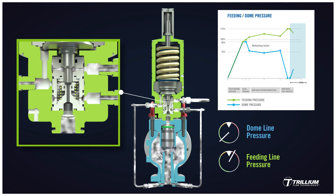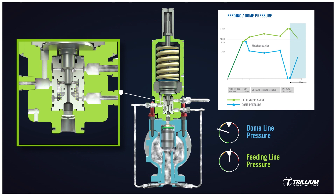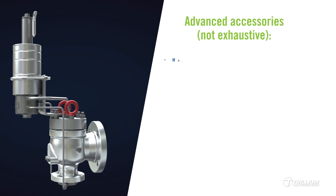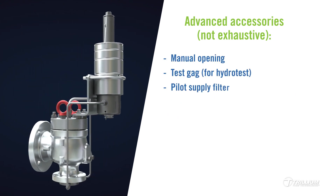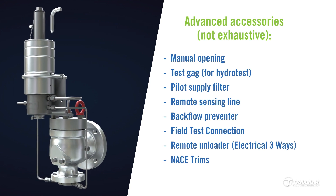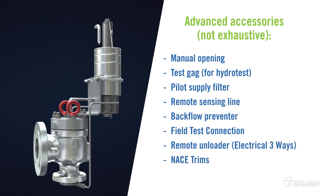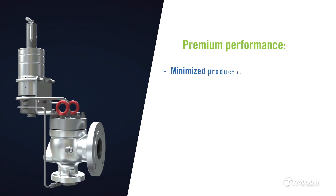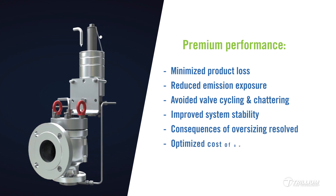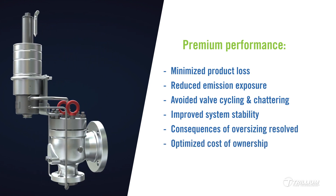The valve operates in total symmetry. As inlet pressure continues to decrease, the dome pressure stabilizes at 70% of the inlet pressure. The main valve is balanced and back once again to its usual closed position. Once closed, the pilot is unbalanced and inlet and dome pressures merge with each other at a pressure below the vent pressure. The DMS pilot is the first modulating pilot that has a separate pressure sensing line for the full pressure range. It is also the most advanced pilot-operated valve design to provide tight shutoff at 98% of set pressure. With several thousand valves installed globally, Trillium Flow Technologies' modulating pilot valve design ensures for end users minimized product loss, avoidance of oversizing consequences, and reduced environmental pollution in any relief situation.